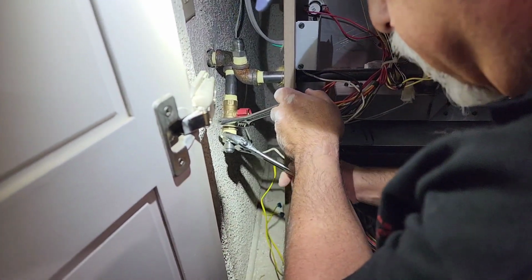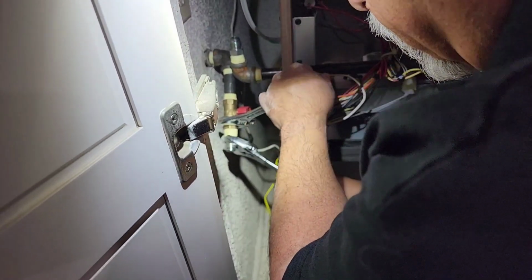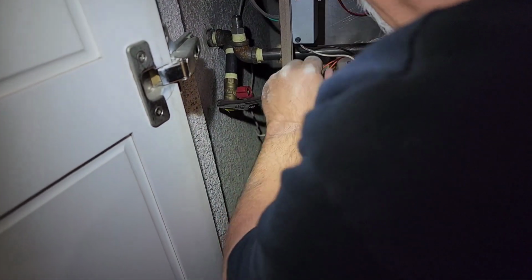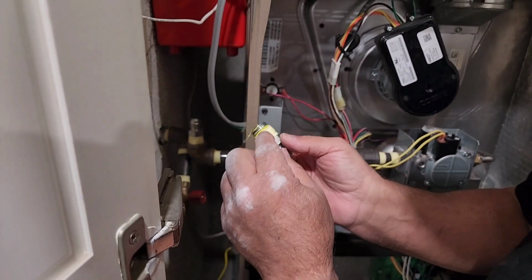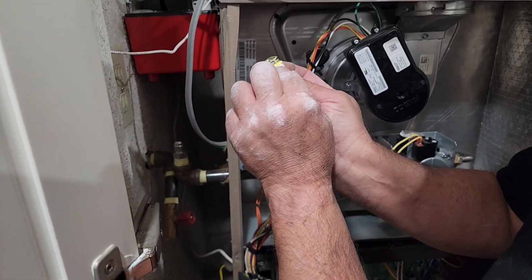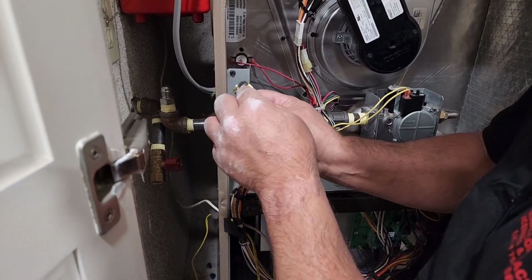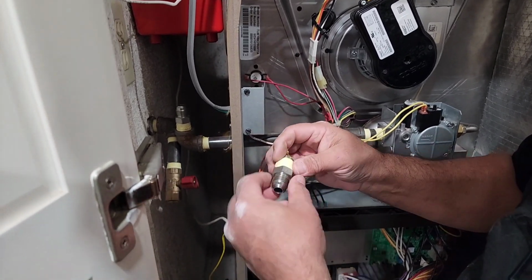Okay, so now we're going to go right here. This is what I'm talking about, guys. If you notice how this yellow tape is so damn thick that instead of really getting good into the threads, it just pushes it all up and bundles it all right here, just kind of like that, where that blue tape will actually stay in place. I could put the blue tape on and then take it out, and you can see all the blue tape in each one of the threads. It just works much better.